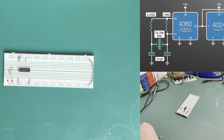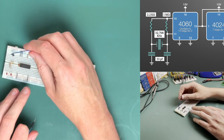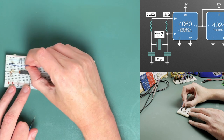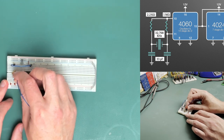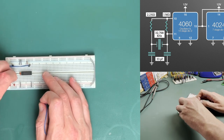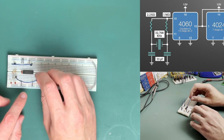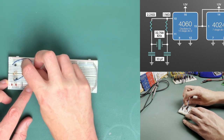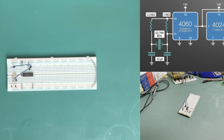So we just now need to hook in to two places coming in from the oscillator and the crystal. The first place we want to tap off is the common point of these two resistors, and that's going to go over to this pin here. The second point we need to tap off is just the other side of this biasing resistor, but just before the crystal. That should be everything for the first stage, so let's hook this up and give it a test.